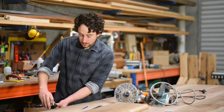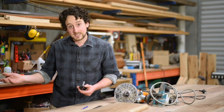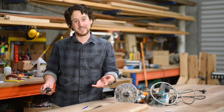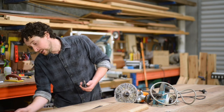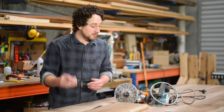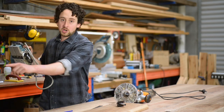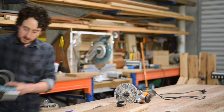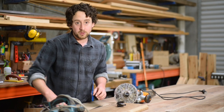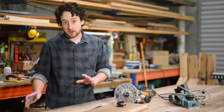This router bit is going to sit on the edge and turn, pushing that blade in this direction. So just as your hand would get splinters, the blade on this router bit is going to lift those fibres and tear them out, potentially ripping a chunk off the side of the table that you can't repair — which could be really problematic for a table that's this big. I've actually got some really clear splinter lines on the side here which I know will tear out if I'm not careful. So I've grabbed my electric planer and ran over this chamfer before using my router from the opposite direction, because I know that that will not cause tear out. I took a few mil off at a time, ran the planer in this direction in a number of passes until I brought that chamfer down pretty close to where I actually want to end up with this router bit. That worked perfectly — I didn't get any tear out at all.